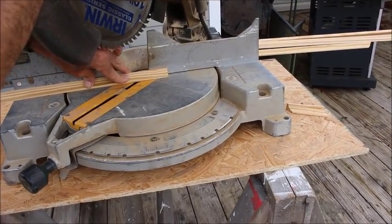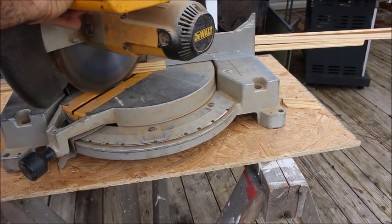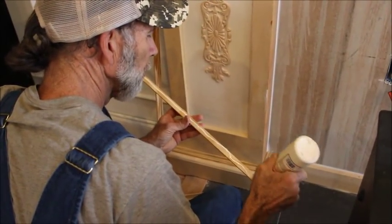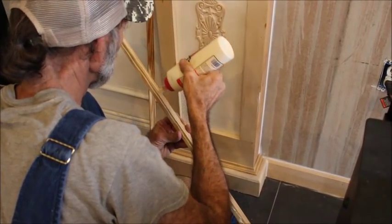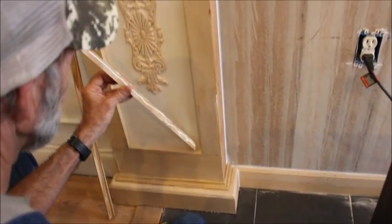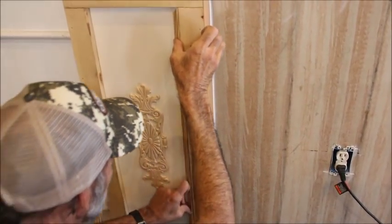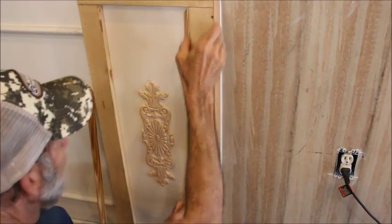We're eyeing the blade because with trim work I'm very precise. I like my trim work to fit extremely tight — I don't like loose-fitting trim. I do have a brad nailer but I don't brad nail everything. I've learned over the years that when you're doing small detailed work like this, a lot of times gluing is one of your better options because it actually holds better than nails do, and then you don't have all these little tiny holes that you have to putty up.